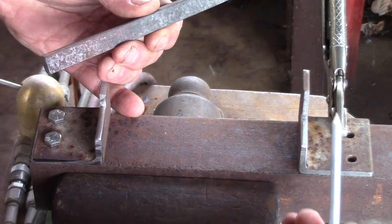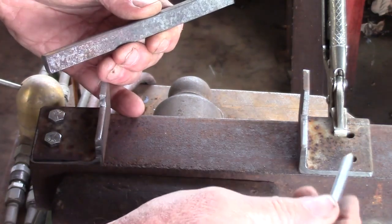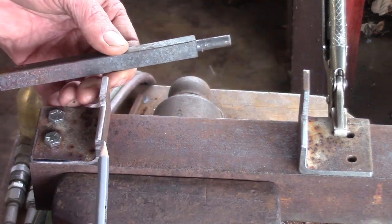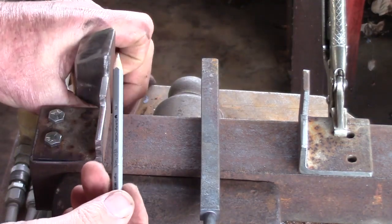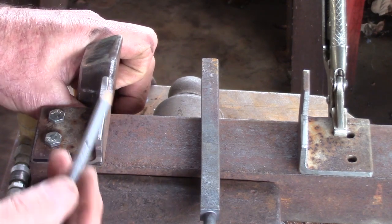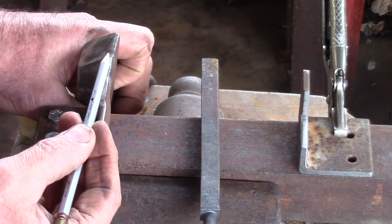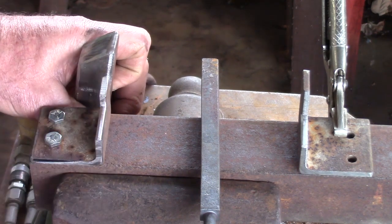This particular piece is held in place by a vice grip — I do have some bolt holes if I need something more permanent. This is the variable end; the other end is fixed. On the fixed end I've got a chamfer that matches the jaws of my butcher, and because this is wider than the apex of the butcher there's a relief on the backside. The crown is the same, so when I use this to mark my tenon it will fit in my butcher dies.